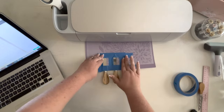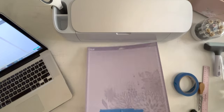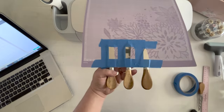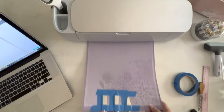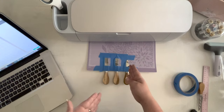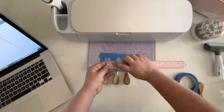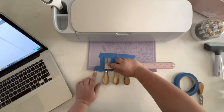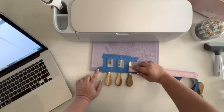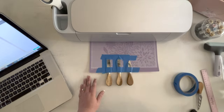Right, that should be pretty good. So now essentially the open areas that you can see are really where our engravings can be. So the designs are already sized. We just have to line them up on those axes. Each of our designs is no more than a quarter inch wide. So if we put that quarter inch here, right on the 3, you can see right on the 5, right on the 7, we should be clear in all 3 places. And then we will get started.